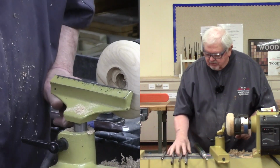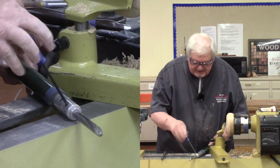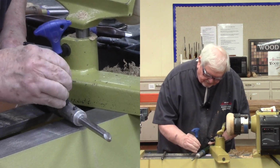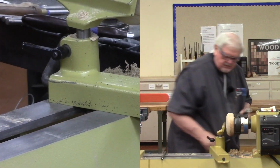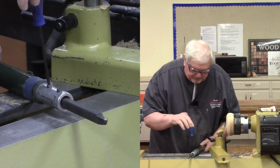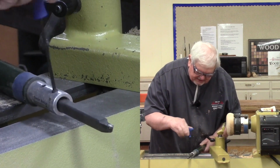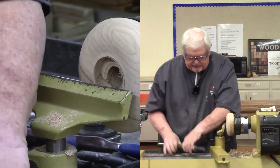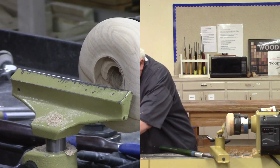Bring out my handle, which I will insert that tool in. And lose my bowl gouge. And this will slide right in here. Now I can set it the length whatever I like. Short probably is better. And I want clearance, so the tailstock on this blade I don't have to take it off. I got a lot of clearance.